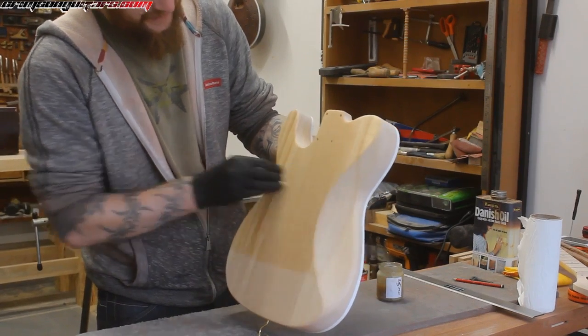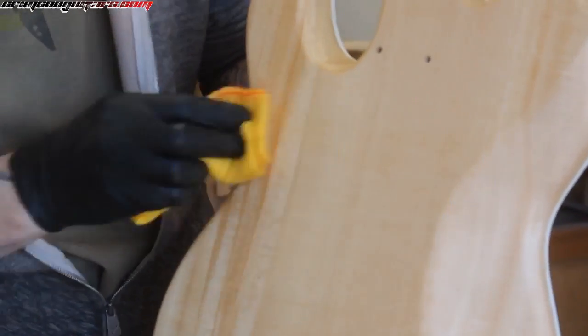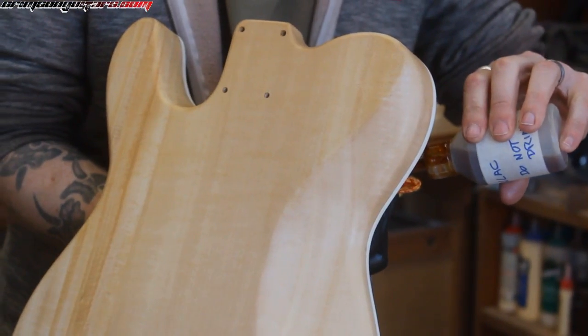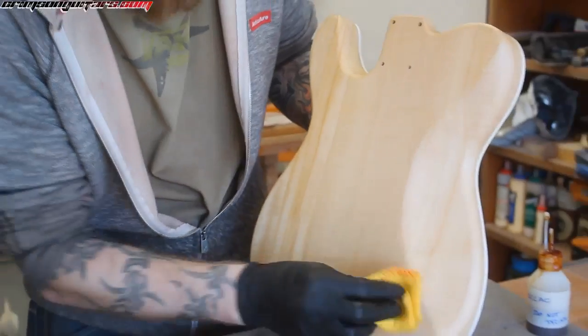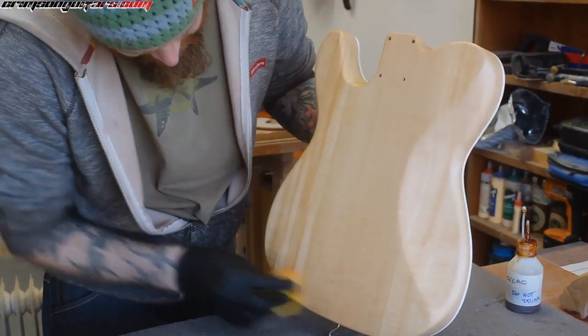So the oil goes into the wood and penetrates, making a lovely sheen. And then we start applying shellac on top of that. Build the shellac up to give a layer of protection, and we're using a darker coloured shellac. It's quite strong, and a nice thick cut that we made here, or mixed here at least, and it's going to colour the instrument a little bit.